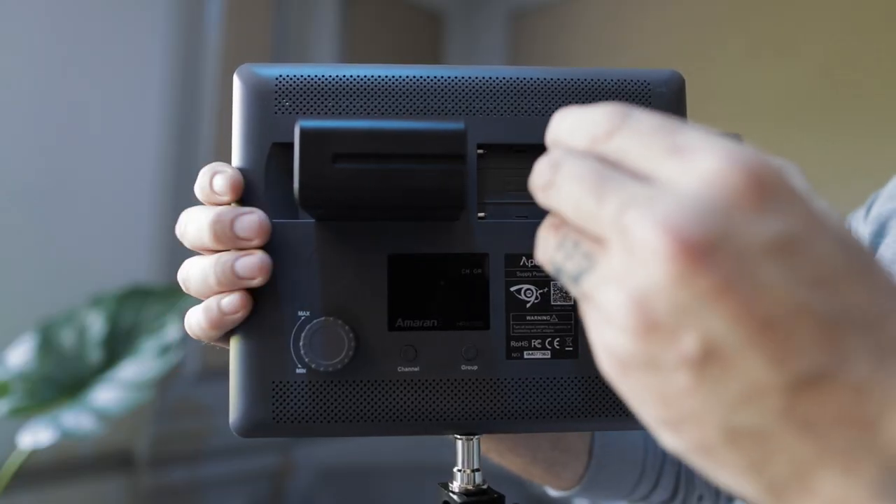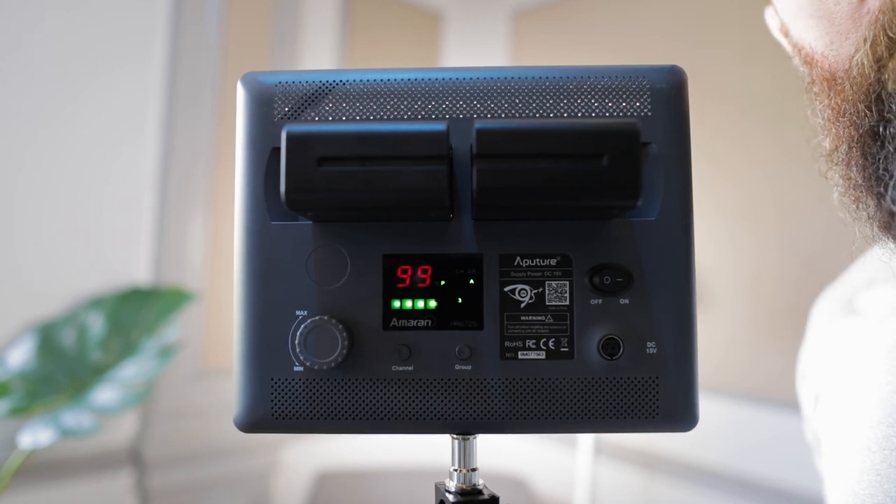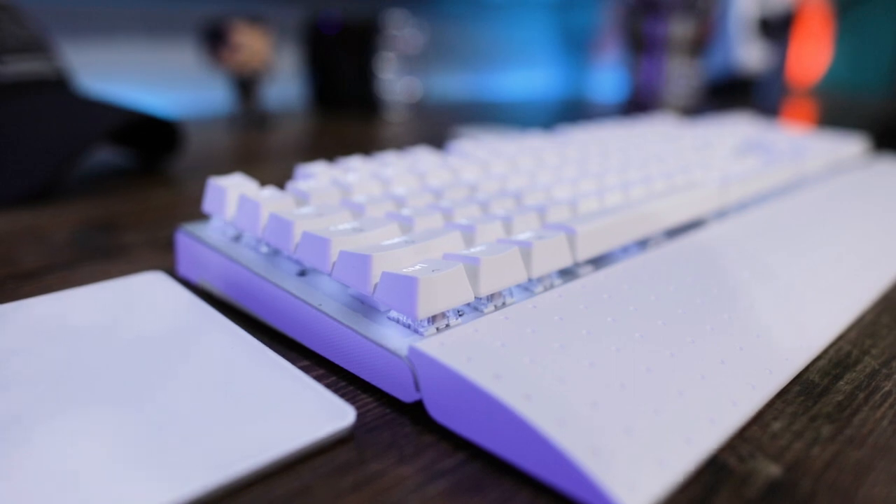As far as color goes, the 672S is a 5500K light — this is the single color version, not the bicolor version, so you're just dealing with 5500K, which is a very nice white daylight kind of light. It has a 25-degree beam angle, which is nice and narrow, giving you some versatility — you can use it undiffused for more of a spot, or diffuse it to spread the light and get a nice soft wrap. Aputure have made this a flicker-free light, which is important because some LEDs at certain frame rates will flicker, and even at a very high frame rate of around 180 frames per second these lights still give you nice even light.